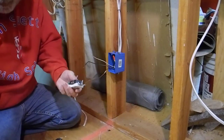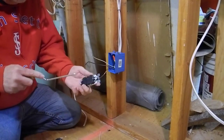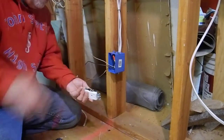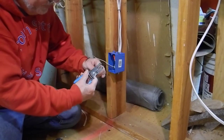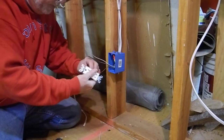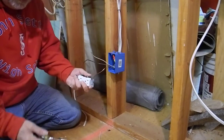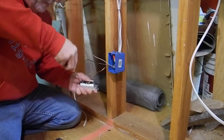So we're going to hook this thing up. Let's screw those in since these are in parallel anyway. We don't want that sticking out. Let's hook up our ground first. Notice when I go with the screwdriver like this, it's going to turn in this direction, so we want to make a curve this way — for the right-hand rule, that would be negative K. This thing has a little hole in it that helps us make a curve that'll go in there. Put her on there. Sometimes you can take your needle nose and kind of crimp it around there, and you could do this with the offset or a standard screwdriver.